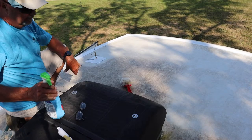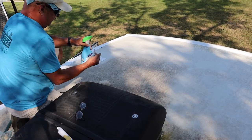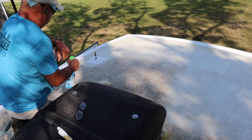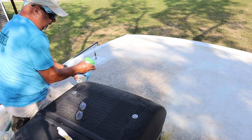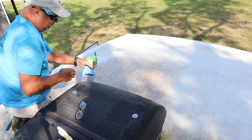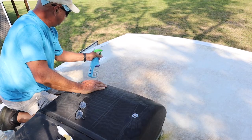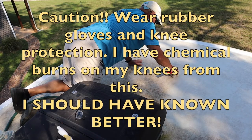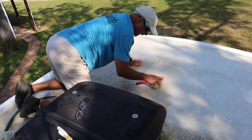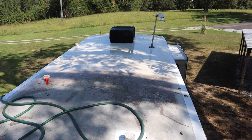I was going to use a car wash brush to wash all this, but it's just not going to do the job. So I'm going to wash it all by hand with this brush, like I've already done some of. I'm using Fantastic all-purpose cleaner with bleach - just spraying it on there. I found out if you let it set for a minute or two it does much better. I read online that bleach doesn't hurt these kinds of roofs - they say it's a good cleaner, it kills the mold and mildew that can actually hurt the TPO roof. Making some progress, but I need to go get some more cleaner.